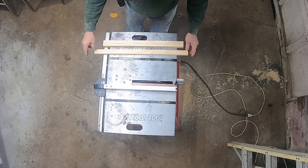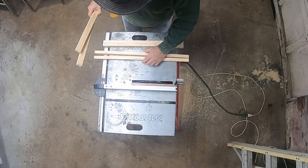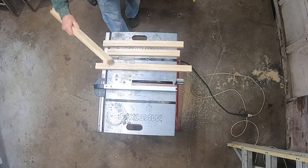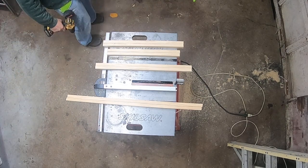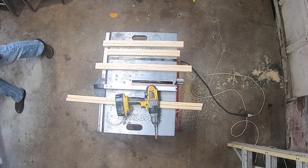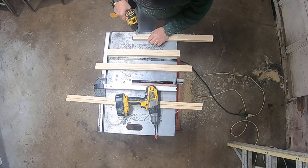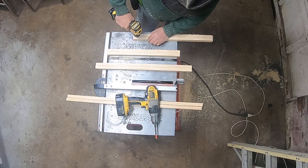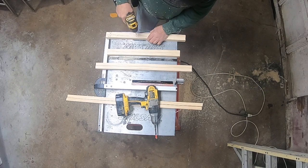Now for the next step, we're going to go ahead and set these up and we're going to pre-drill them so when we have our panels built, they'll be ready to go. I have two different drill sizes here. You know that the head of your screw is bigger than the screw itself — what I want to do is countersink these screws. Pre-drill through with the small drill. I like to do about three or four in here and I don't like to have them in exactly the same spots in the middle.